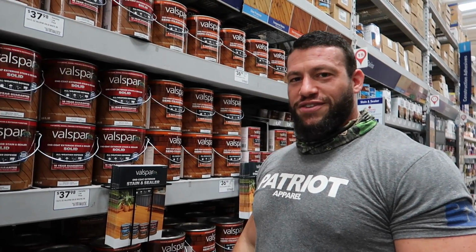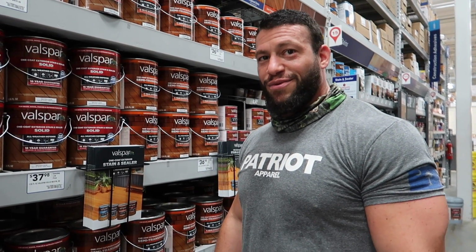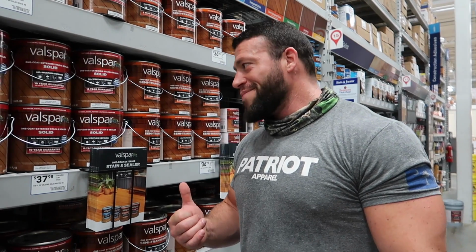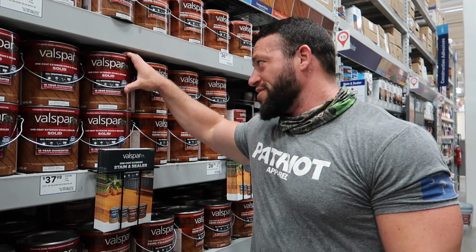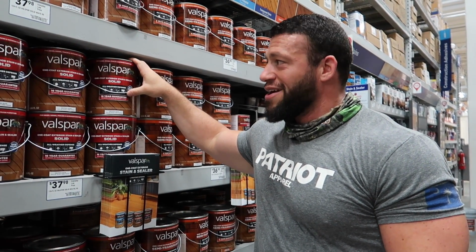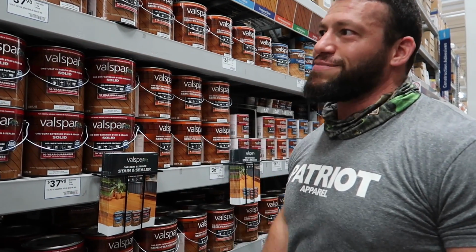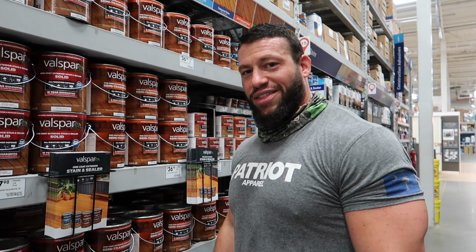We're looking at finishes for it because this one's going to be an outdoor stone platform. Maybe one day it'll find a home inside, but for now, it's got to live outside. So we're doing pressure treated lumber and looking at a deck stain for it, something that'll hold up to the sun and mostly water. We won't let this thing fall apart in a year or two. So we're looking at a solid color deck stain, because I think it'll give the best defense. Basically what you'd stain your deck with. You know those hold up for years, so we're going to go with something like that.